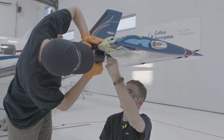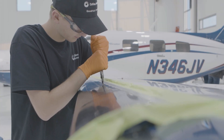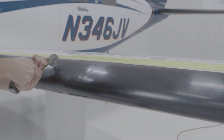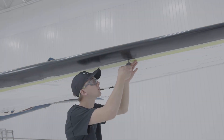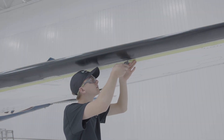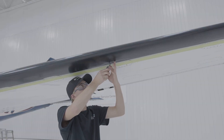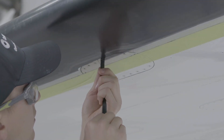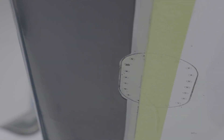Once the de-icer is completely bonded, use a steel stitcher to properly bond all de-icer edges as well as the round air connection. Use a knife to trim de-icer cutout areas, recessed edges, or edges that butt against adjacent de-icers as required. Ensure that you do not trim the de-icer edge closer than one inch from the inflatable area, as this could result in air leakage or seam failure.